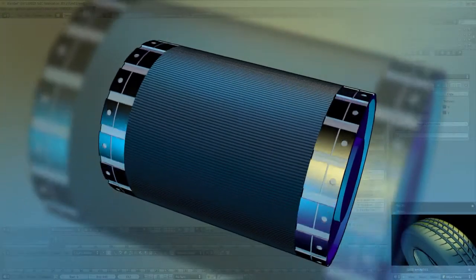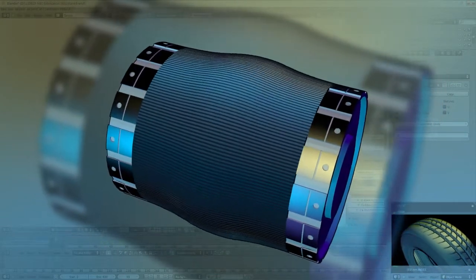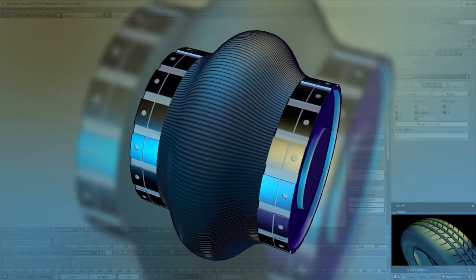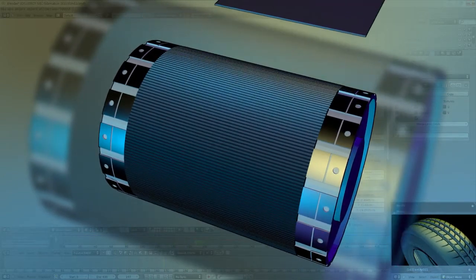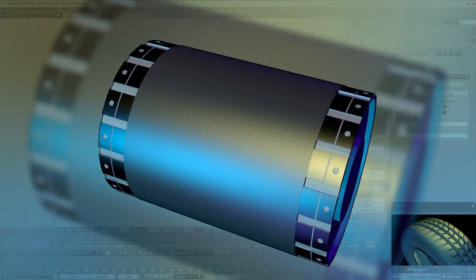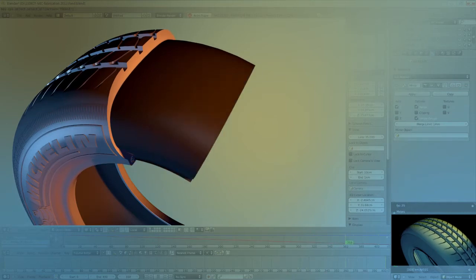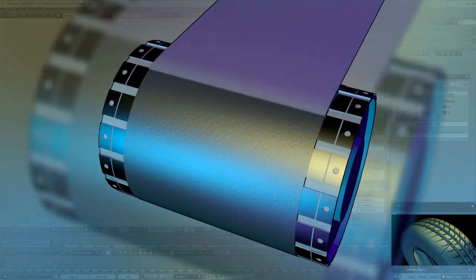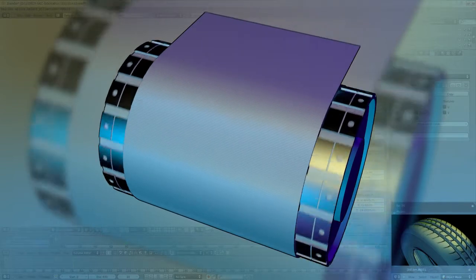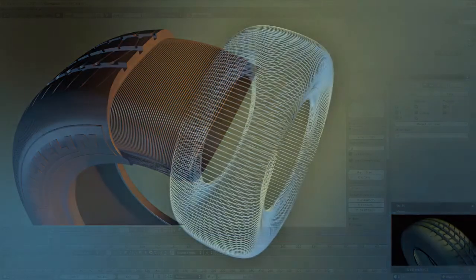Production then starts on the drum, a rotating cylinder with edges that can be brought together and the center that can be inflated. We shall see why. The first element to be laid on the drum is a thin, airtight sheet of synthetic rubber which acts as an inner tube. It is then topped with a fabric ply encased in rubber. These cords form the radial carcass of the tire.